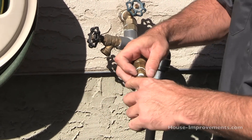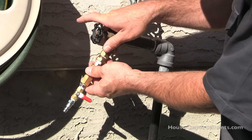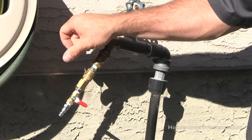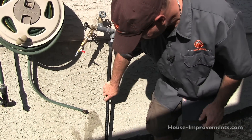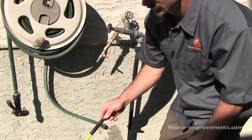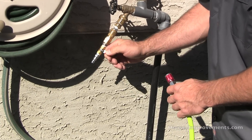This is a couple of different things put together to make this really simple, so just rig up whatever you need to make your own system work. I'm going to put that on there and open this valve because you need that open. We've got our compressor set to about 70 pounds. Most of these lines — even on this one — it states right here on the tubing that it's good to 75 PSI, so we've got the compressor set just a hair below that. I'm going to open this one just so that we don't rupture a line. Here's our air hose coming right from the compressor. This valve here will turn our air on and off.